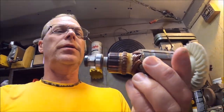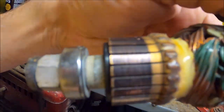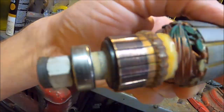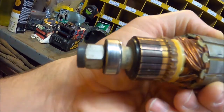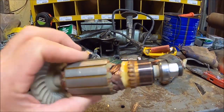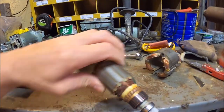Back from the electric place. They checked everything out and like I said, there was nothing grounded or shorted in the armature or the stator. But one thing he did say is the commutator is a little bit dark — the brushes were really in good shape — but he said go ahead and sand that. He's cleaned one up before and couldn't get it to clear the growler test, but it still worked fine. So he said give it a shot, for whatever it's worth — put it back together, hope for the best.